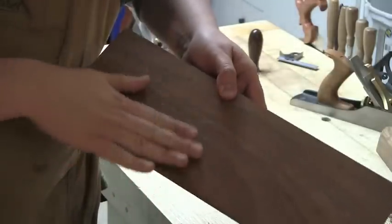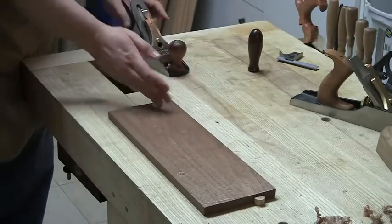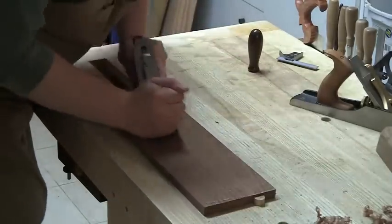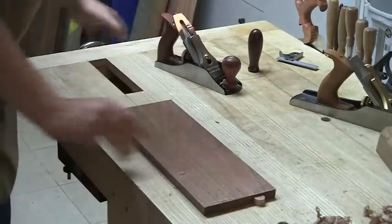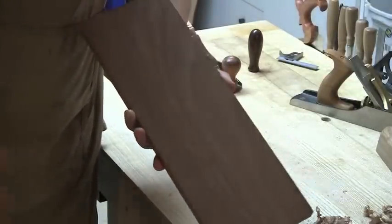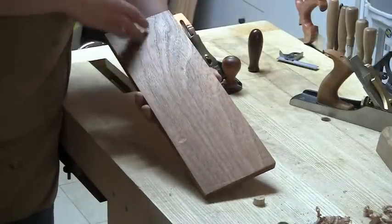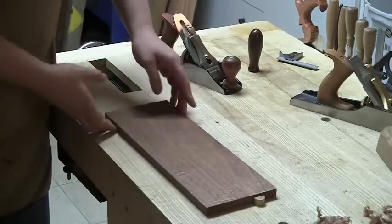I've got just a little bit of the X marks right in the center that haven't been removed, but the rest has been taken off and I've got a really incredibly smooth and shiny surface. Now I'll work from left to right back across the board, taking passes side by side, slightly overlapping, working my way back across. And now I've removed all of those white marks and have a beautiful board that's ready for finish. It feels so smooth and wonderful, and the grain really pops out now because I haven't abraded the surface — sandpaper scratches the surface, whereas planing removes a consistent thickness and gives you a much cleaner, more vibrant look at the grain.